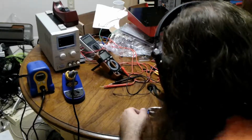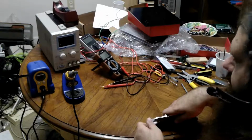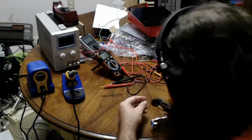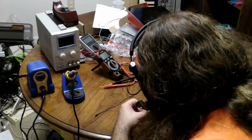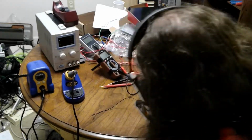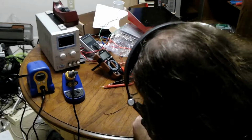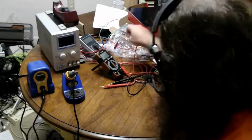I asked my mother about it, and she said the reason to actually use a crimp tool is because it doesn't just squeeze flat, it squeezes in multiple points and helps it lock on better. And I have no doubt she's right. So if I were making something to sell or to give to someone else, I absolutely would have just stopped this video and gone and gotten a crimp tool. But this is for me. I'm the only person who has to be happy here, and I will be happy when this middle part is crimped. Blah! And there, ladies and gentlemen, are homemade multimeter probes with breadboard connections.